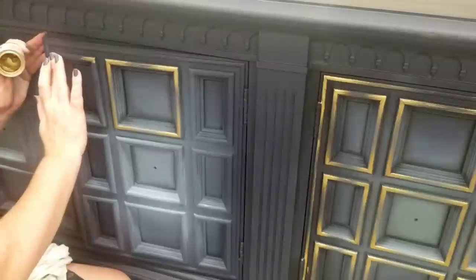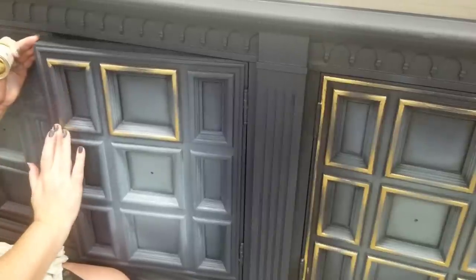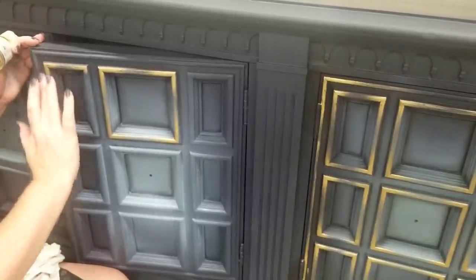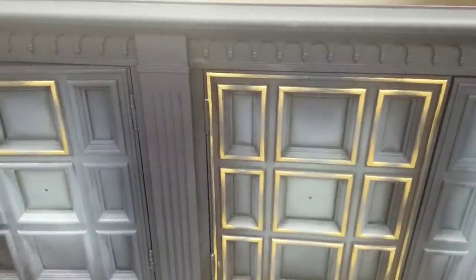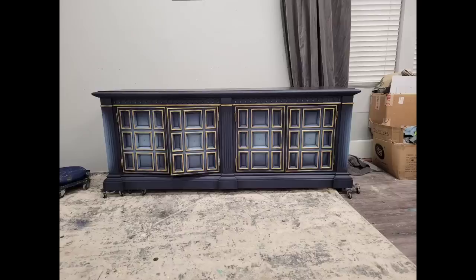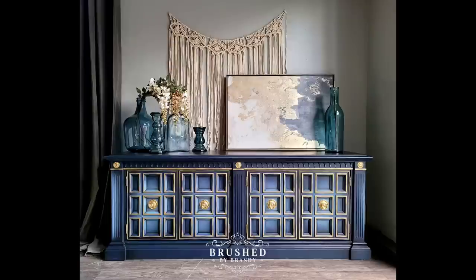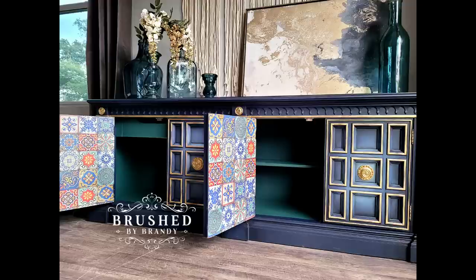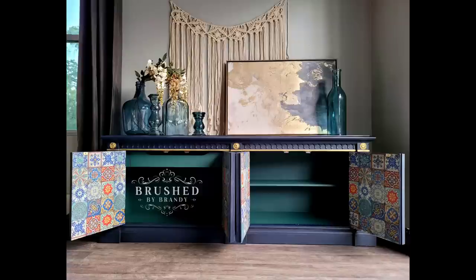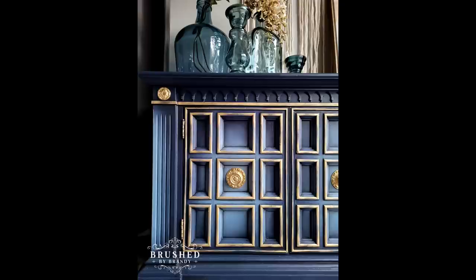This gives a really pretty smudged look — heavier in the corners and lighter going towards the center of each box. With the dark smudgy wax in all of the crevices and the gold highlights on the outer edges, it gives these boxes depth and dimension. This is a pattern I repeat fairly often: I like to use dark waxes or dark color in the lower crevices of my paint finishes, and something lighter and brighter on the outer edges — the contrast of colors creates that depth and dimension. Here you can see my piece with all of the wax detailing done. I went ahead and sprayed the entire piece in two coats of Dixie Belle Gator Hide, then came back and added my original hardware that I had spray painted in a gold finish. The sides of this piece got a little bit of gold stenciling with the gilding wax, and on the inside you can see the paper on those drawers — everything ties together that theme of squares. This piece has a real wow factor, and the goal was to make sure the details of the piece really stood for themselves, and my paint finishes didn't try to compete with them.